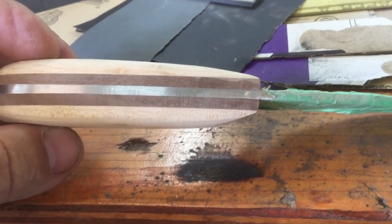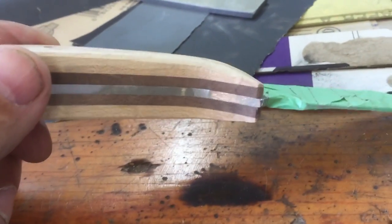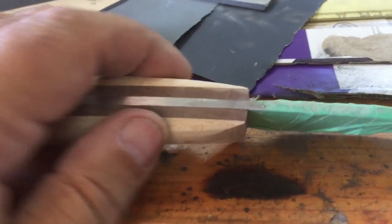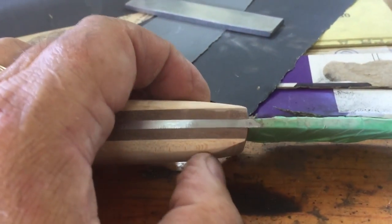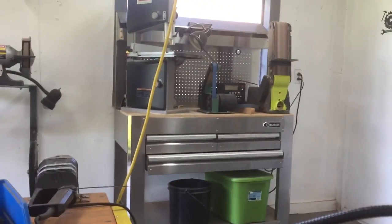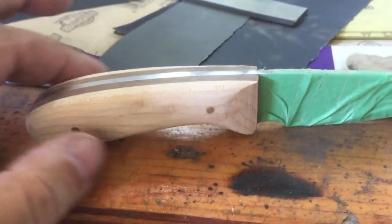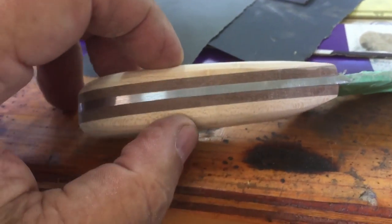I've got this rough-sanded — the rest I do by hand. That's probably three or four hours of shaping and rubbing to get everything exactly equal. You see this radius right here? Well this one is a lot flatter, so I gotta put it back and make this appear to be exactly like that. Most of the time I do this by hand, but I'm fixing to put it on that small belt sander right in the middle. I still haven't gone so far along that I can't smooth everything out by hand after. I even take calipers and make sure everything's equally as thick on both sides.